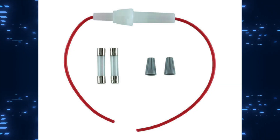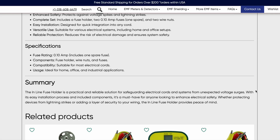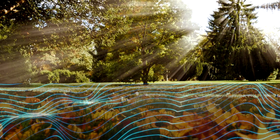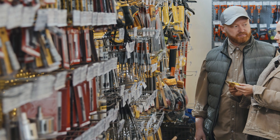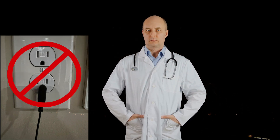I do recommend using the earthing cord with the 100,000 ohm resistor and not bypassing it. As an additional safety measure, you could install an inline fuse — there's one available on this website. This fuse won't protect from direct lightning strikes; mostly nothing can. However, it could prevent a ground current that travels within the ground after a lightning strike happens near the grounding rod. If you're concerned about lightning strikes, it's better to disconnect completely from the system during lightning storms.